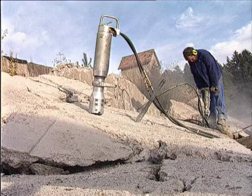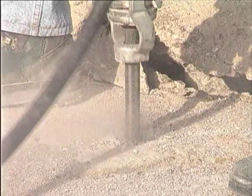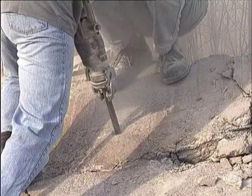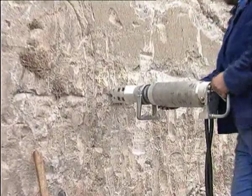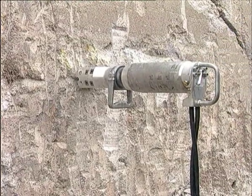Let us put theory into practice now. At first, drilling for the splitting process has to be carried out. Holes must be drilled at a specific diameter and depth. Then the wedge set is inserted into the hole, checking its position before shifting the handle that switches on the control valve.